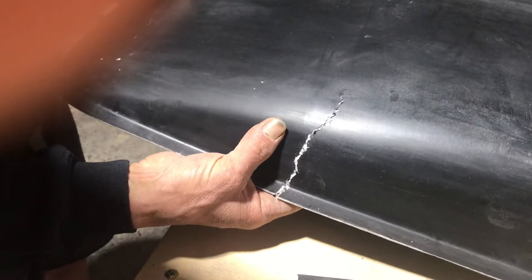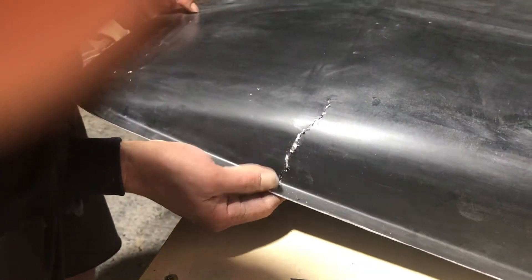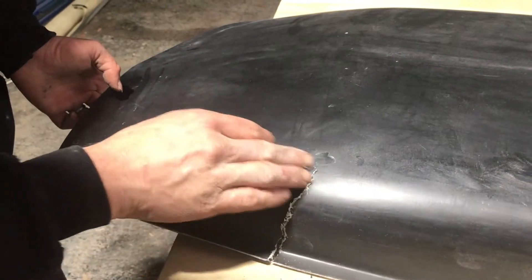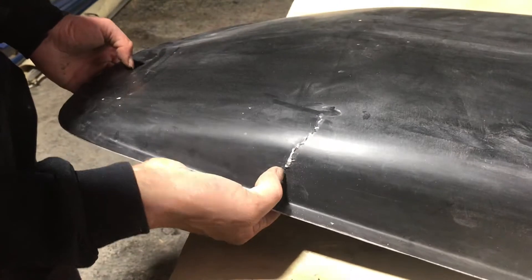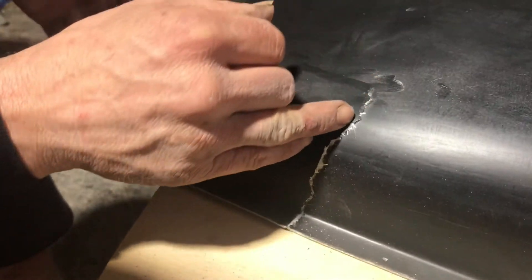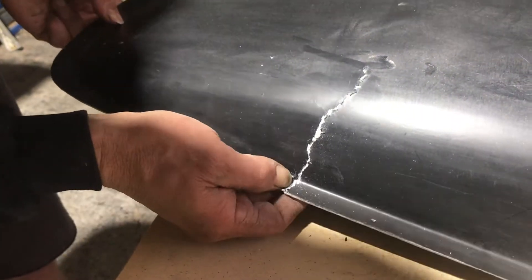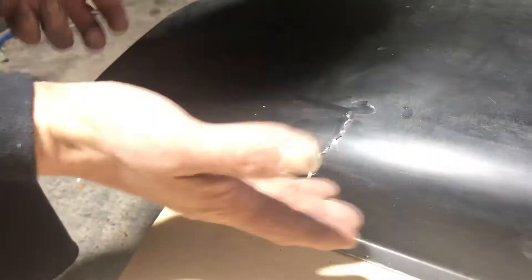We've got a crack here. What we have to do first is get it to sit back in exactly the same position that it was in before it had the crack. As you can see, it's a bit proud here — it's actually quite difficult to get it to sit back because all the fibers are torn and broken. I'm going to run the grinder through here a little bit to separate it more so it sits back how it was, but I don't want to run it all the way through because I want some datum points to work from, just to make sure I get it back in exactly the same position so we know the thing's going to fit right.